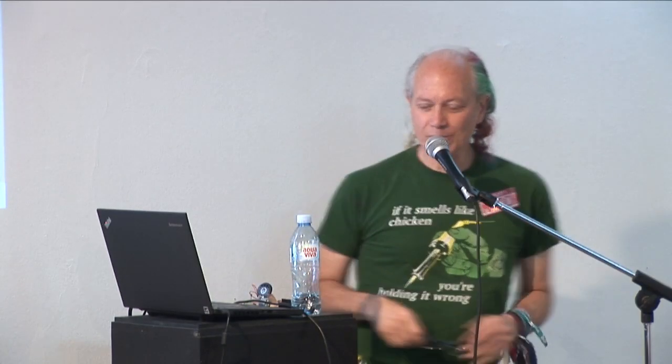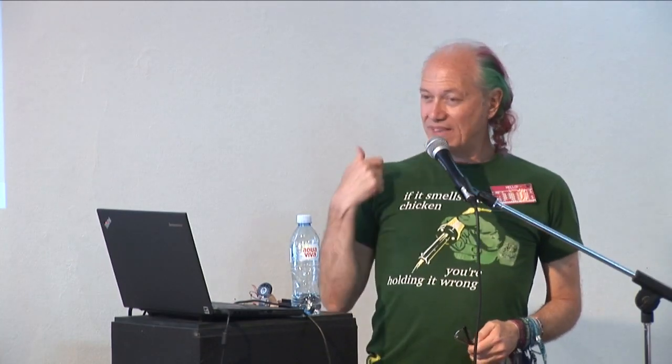So remember what the Hello World program does. It only does a little bit. It says, make pin 13 an output pin. Then make pin 13 high, which turns the LED on, and then make pin 13 low, which turns the LED off. And that's pretty much all it does, except remember we have to have a delay in between, otherwise the computer going at 16 million times a second is going to turn the LED on and off too fast to see. So we turn the LED on by making the output pin high, keep it high for a second, and then make it low, turning the LED off. And then we keep it low for a second, and then in this program we repeat over and over again.